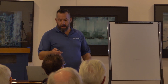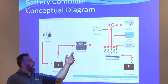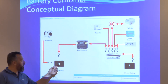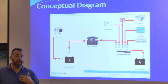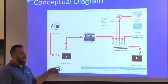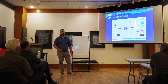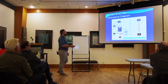The problem with fuses and combiners is this: as battery banks get bigger and you have large loads, you get nuisance tripping, and nuisance tripping is really hard on an owner. Nobody's monitoring fuses on their boat. If you're not monitoring voltage, how are you going to know that a battery is not getting a charge? You might be blissful — you get on your boat, everything seems happy. Most people are like, everything works until it doesn't. You just don't know that you suddenly lost the benefit of recharging your battery through a combiner. Eventually your thruster battery dies — maybe a golf cart battery or a Group 31 AGM at $400 a piece — and you lost two of them. That's $800 lost because a $25 fuse blew.